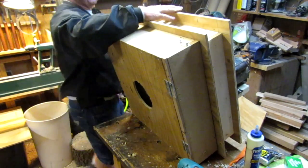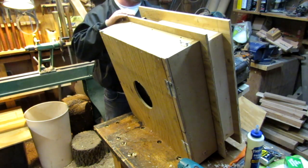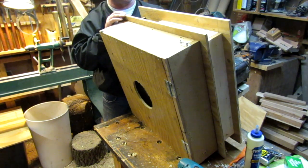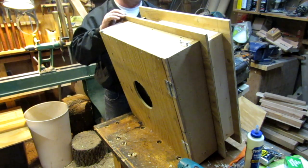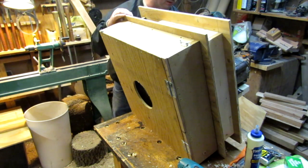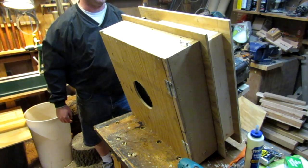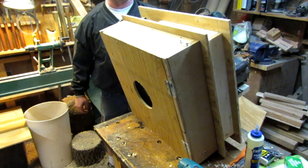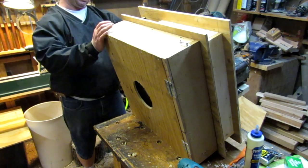I've got the impeller and fan built, and they're in this section here. The housing, the motor is back here, turning a pulley. Over here, the pulley is a 2 1/4-inch pulley, which reduces the motor speed down. This motor is 3,450 RPM. I may even go slower because that thing is really getting it a lot faster than what I expected. I really wanted to try to get it around 1,700, but to do that, I need a 3-inch pulley. So we'll see about all of that.